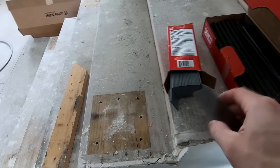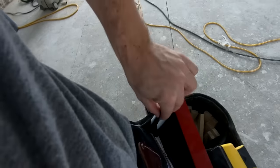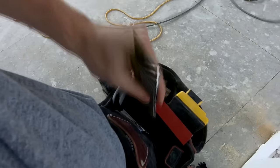As far as nails go for baseboard, I like to use inch and a half 18 gauge brads to nail my outside corners and any small pieces that might split with a larger nail. For the rest I use 15 gauge 2-inch long, typical for 5/8ths baseboard. I'll load those up in my tool belt and go to town.